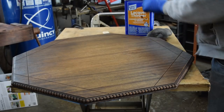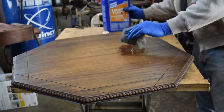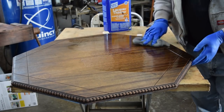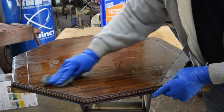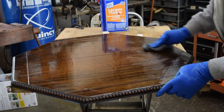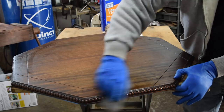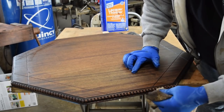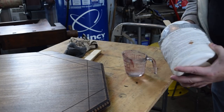The stripper's all been removed. The next step is to scrub it down with a little bit of lacquer thinner — that'll get any remaining finish off. You can also see that those water rings are still present. I was kind of hoping they might disappear, but no such luck, so we're going to have to deal with those shortly. Another safety note: follow the directions on the can as far as ventilation, open flames, all that stuff. Then we'll do the same thing for the edge moldings — work that steel wool right in there to make sure we get the last of that residual finish off.